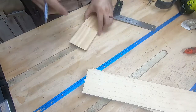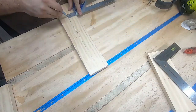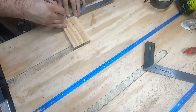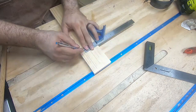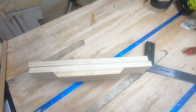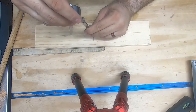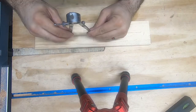While the glue dries, I start marking out the center lines of the shelves. The two for the balls need to be divided in half, but for the ring shelf, I set the line closer to the front. Then I use a pair of dividers to mark the center points for the holes I will drill in the next step. I make sure to leave enough of a gap in between each one, and for the rings, I actually use my own ring as a measure.